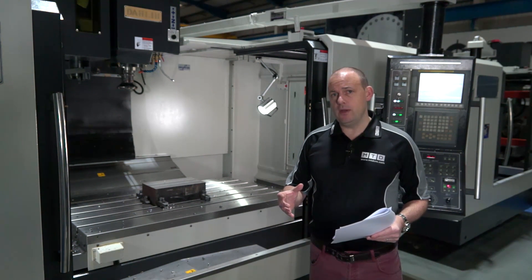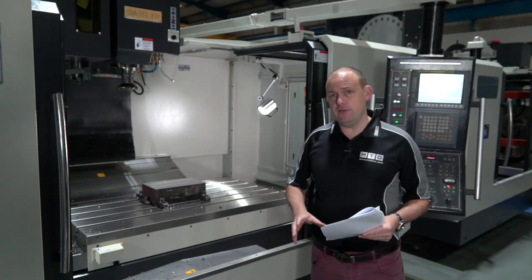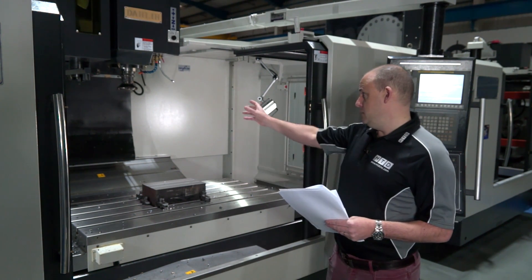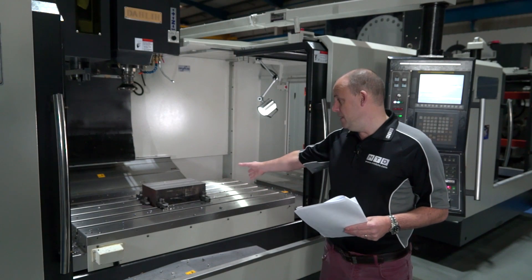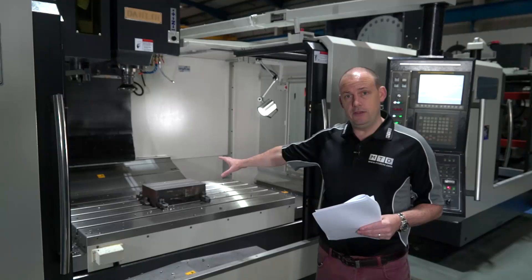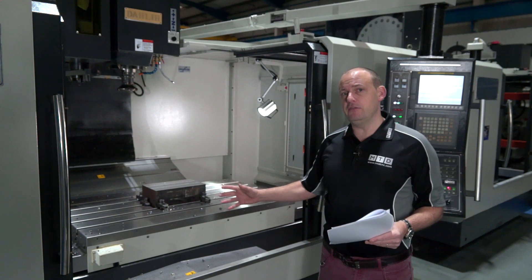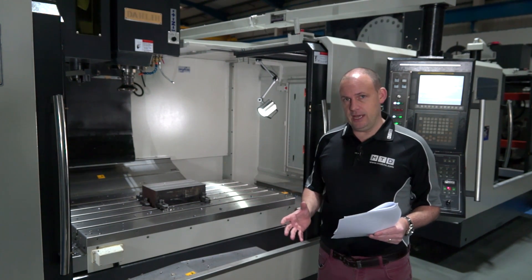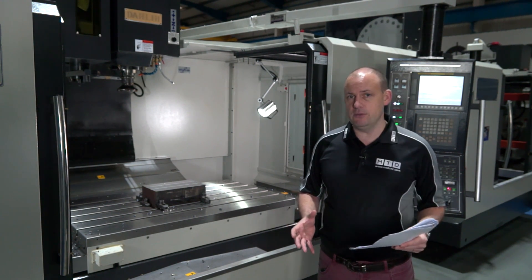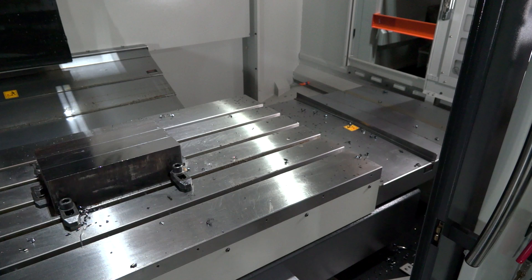The cutting demonstration we're going to see in a minute: this is a piece of stainless steel — we're going to run the spindle at 450 RPM, cut at half a meter a minute feed rate, at a 6mm depth of cut using a 125mm cutter. You'll be able to see after the machining process the surface finish we're achieving on this block of stainless and also the types of chips being removed. That is what this machine is about — it's brought in by Ward High Tech to service the needs of engineering companies that need a much bigger, much heavier duty machine.